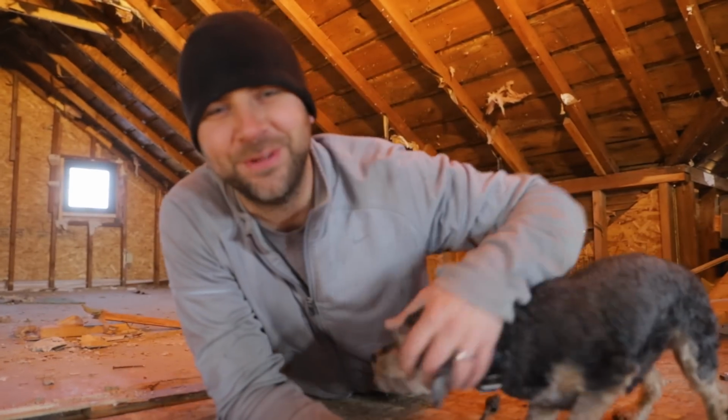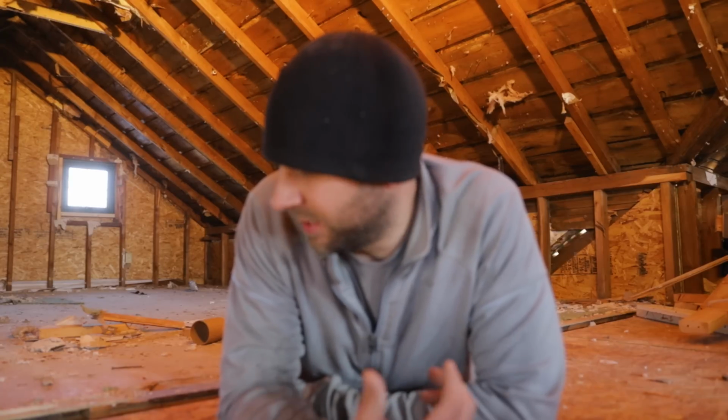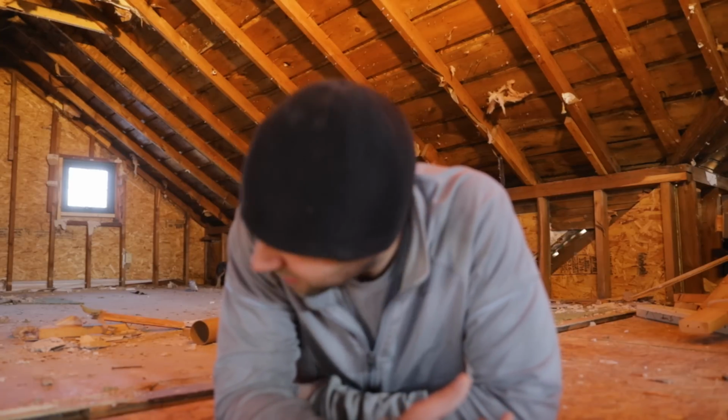I don't know if you could tell from the video or not, but that lumber that I just tore out was actually pretty new. Relatively recently, somebody put like a quarter inch plywood or OSB over top of that and then rebuilt those walls. I haven't done any of this demo yet in this house, so I'm not really sure how this is going to go. I basically gotta tear off that quarter inch and then tear off what looks to be shiplap underneath it.